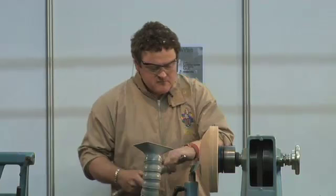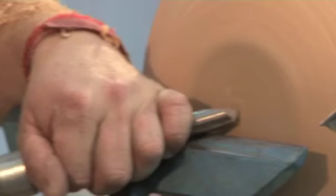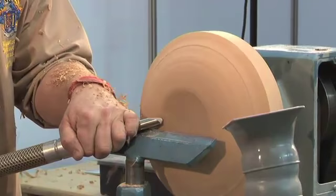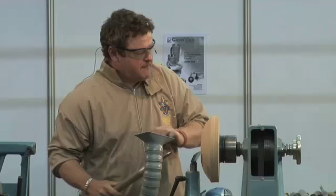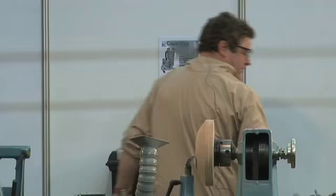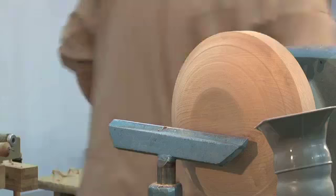So, this one's my one about 10 o'clock and we're just working it back. So I'm gonna give it a little bit more volume. Now I prefer to do a little pull cut across there. I find that slightly more effective into the wood than I would a push cut, because with the push cut you're going to a slower speed, so it doesn't quite work as effectively. So now I've got rid of that torn out grain in the center, so that's a nice and true cut.